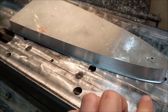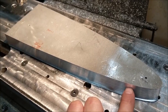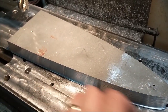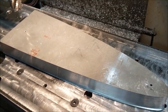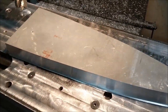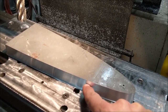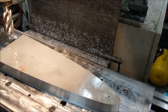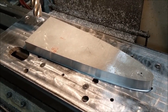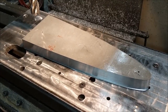What I've been doing more recently is going straight to the first undercut pass, which undercuts the material to about here, then the second pass comes to about there. That way it removes material so when I do the profile cut I'm only cutting a little bit right in that zone — killing two birds with one stone. It's actually getting to the point where I'm thinking I can get rid of the finished profile cut altogether, because the undercut pass is meeting where the round-over tool lets off. For now I'll still run it and show you. Next tool going in is the undercut tool.